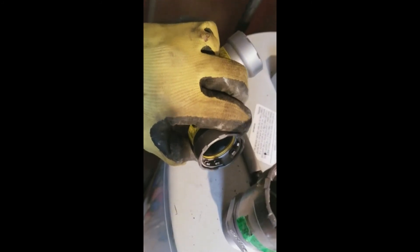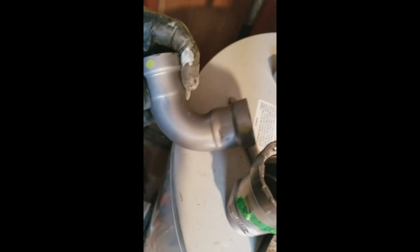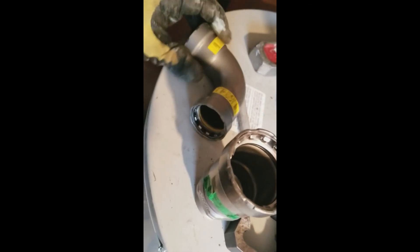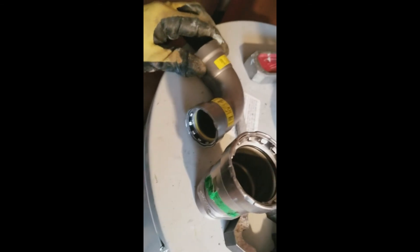This one however is yellow, and yellow is for gas. This is the one inch Megapress yellow for gas. It's very important to specify each one — you would never use the gas fitting in water and you would never use the water fitting on gas. Other than that the fittings would be identical, but it's a very important distinction to not mix up the water and the gas fittings.